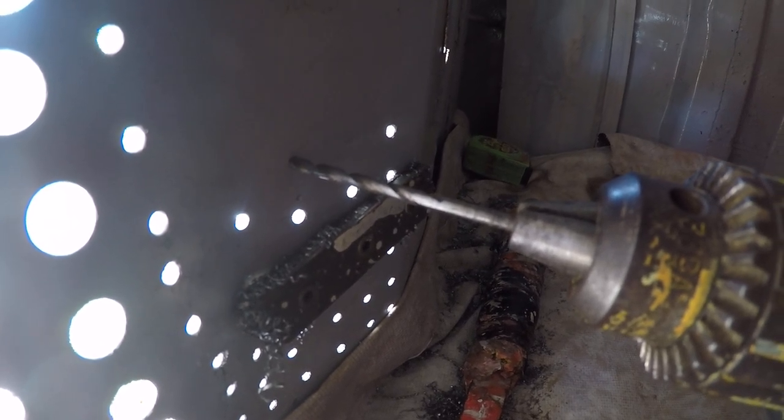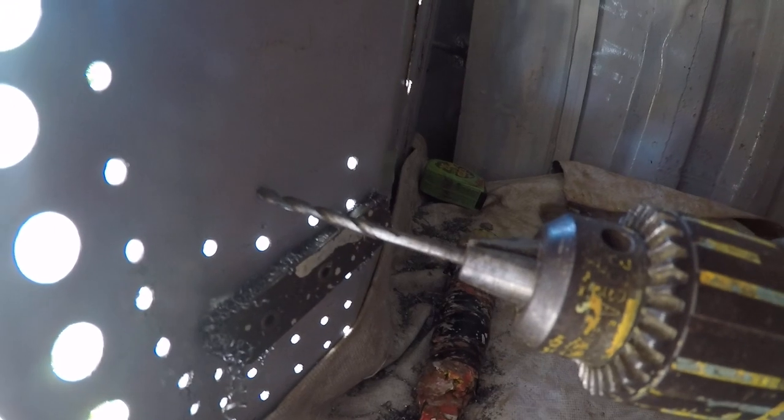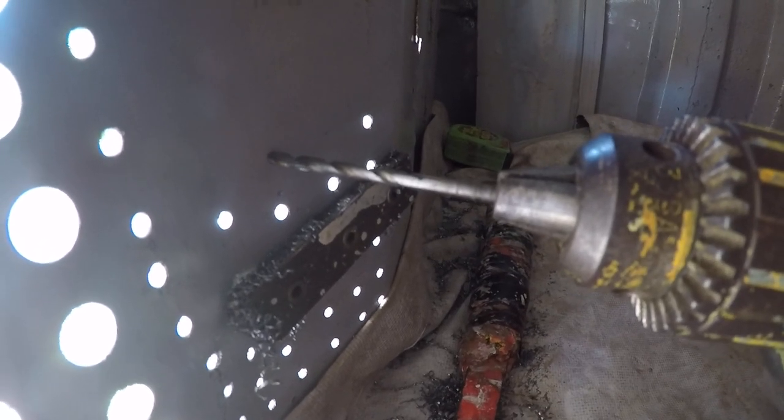You're going to hear the drill — that's how you know where you are in the hole. In the beginning the drill goes very fast, it slows down and sounds different while it's drilling through the steel if it's cutting properly, and when it goes through the other side it slows down quite a bit and there's a completely different sound. Here we go: one, two, three.